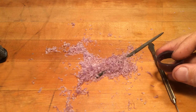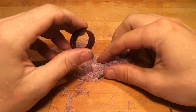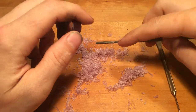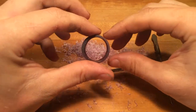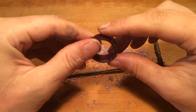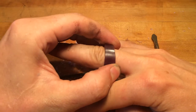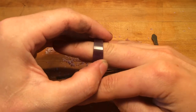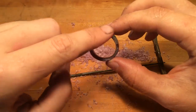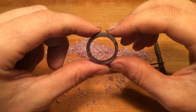You can see how many shavings were produced in this process — quite a few. Don't throw those out; they're going to come in handy later when we start doing hot tool work. But you can see there's also not much left of the wax. This is a pretty large carving — I've got big fingers. But it fits on smoothly and then comes off with a little bit of work, which is about what you want. We've got a slight ellipse: the outside is a perfect circle and the inside is slightly oval.